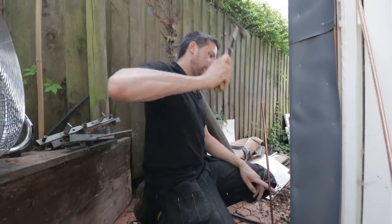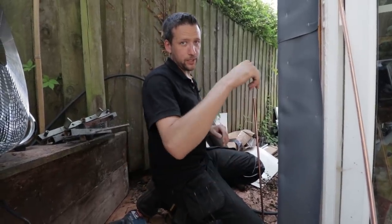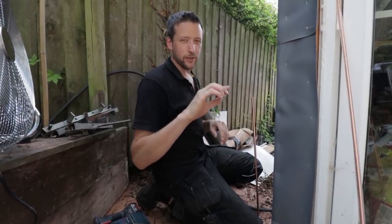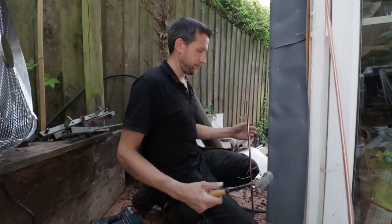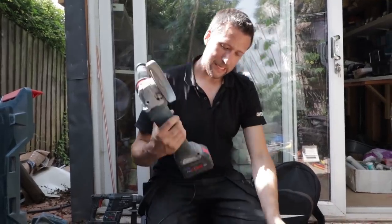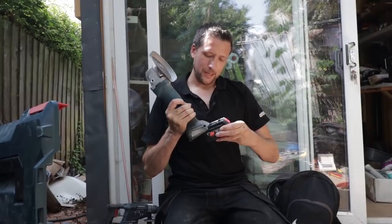A couple of people asked: when you're driving rods into the ground, how do you know you won't hit a utility service? Honestly, most of it is - I don't want to say potluck, but it kind of is. You've seen me doing videos where I put a rod outside the front of terraced houses - you can download charts for your street showing where gas, water, and all utilities are, so you can at least get a gauge. It's still not 100% but it's better than nothing. Here it's just fields all around so the likelihood of hitting something is a million to one. Also, I bought aftermarket batteries for my Bosch gear because all my originals were nicked - waste of money.